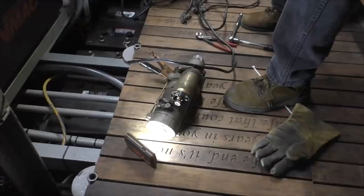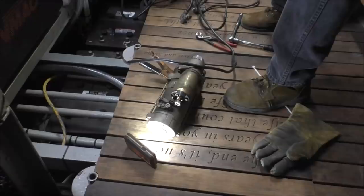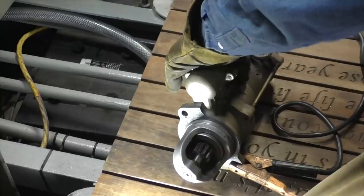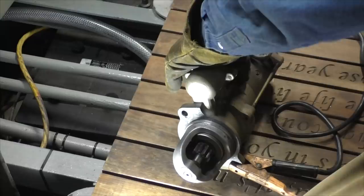That's pretty much stable. We need a bigger pump on the transmission. That gadget is the starter - the solenoid is giving us problems. In fact it locked itself on, so it wouldn't turn off, and we hastily yanked all the cables off the batteries. Let's see if it does it again - be ready to disconnect.